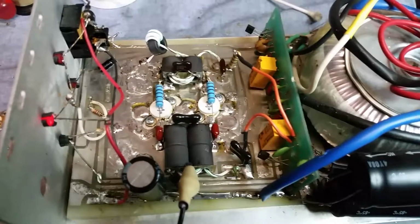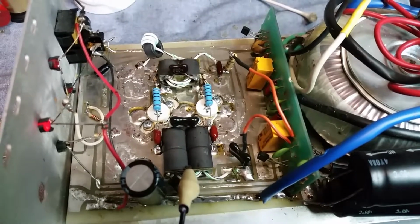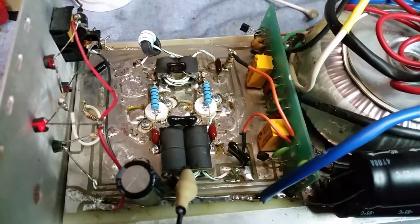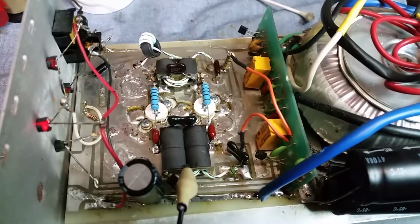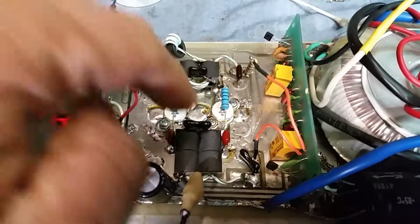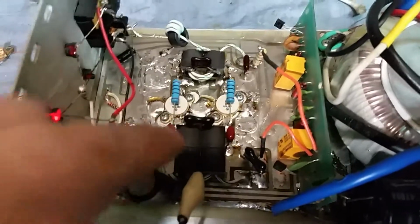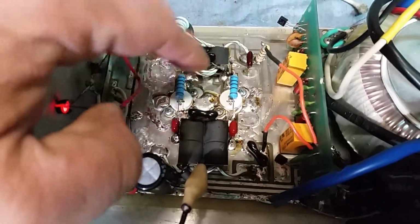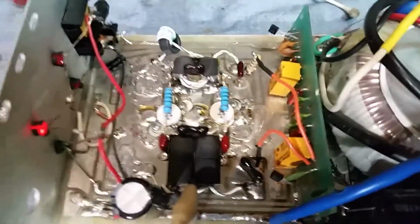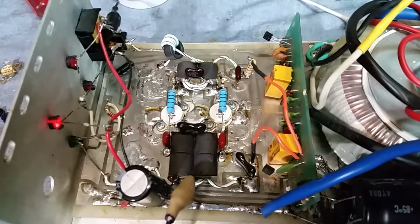I pretty much just had to do a rebuild, man. Just build you a new 2-pill. Use some used Motorola 454s. So it's going to do a little bit more than what it was doing, just a little bit. As you can see, everything's new. The whole amp section is brand new, man, except, you know, of course the transistors are used transistors, but the transformers are still the original transformers, but all the other parts are brand new. And I tuned the input and output out for you. And yeah, man, it came together pretty good.